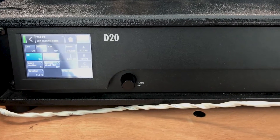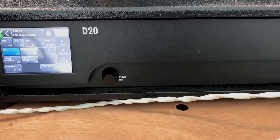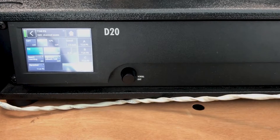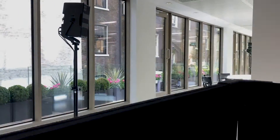This D20 amplifier at four ohms can output up to 1000 watts with a crest factor of 6 dB. If the crest factor is 12 dB, then at four ohms it can output up to 1600 watts per channel. I have connected four of those speakers daisy chained.